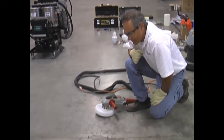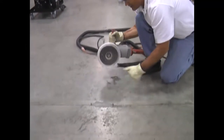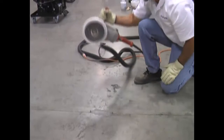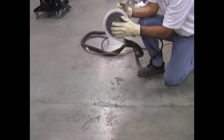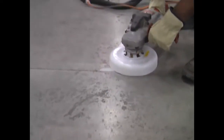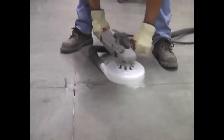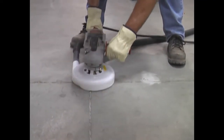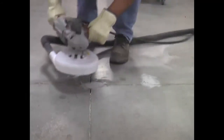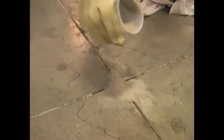It's been about 20 to 25 minutes. We've allowed our Spall TX2 product to cure. This is the product we used with sand to make it thicker and stronger. There are many different ways to profile this down. I'm using a portable handheld dust-free system with a shroud — I'm using a Zec wheel with a 7-inch grinder. It blends in very, very nicely.